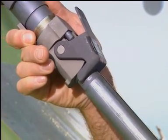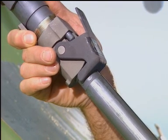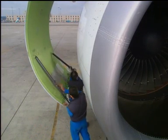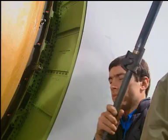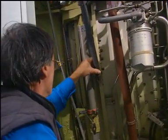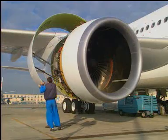Make sure the locks are fully in their slots. Engage the retention locks of the hold open rods with the engine detents — engage the forward rod first, then the aft one. Make sure the locks are fully engaged before you release the weight of the door.